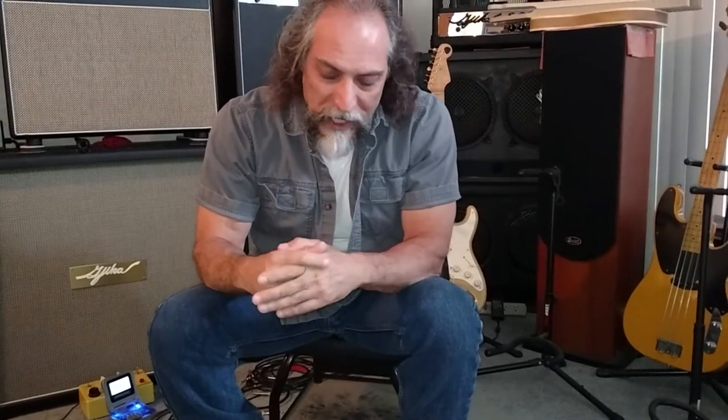Now, Ken was looking for it all in the output transformer. I started looking for it in a different place. But I went to see him once, and he showed me his latest incarnation of his single-ended amp. And I'm not kidding you, the output transformer was this tall. He said he finally got a completely surge-free amp, but it didn't sound very good. He didn't like it either. And the transformer weighed 40 pounds?